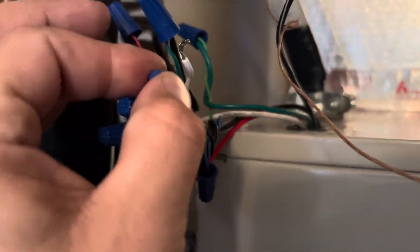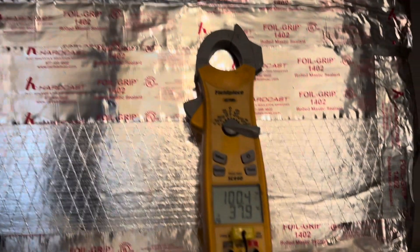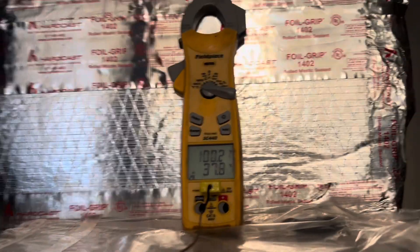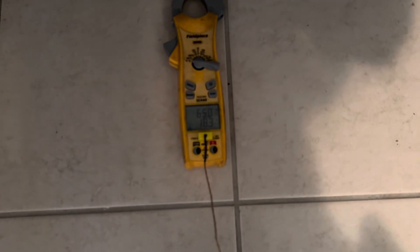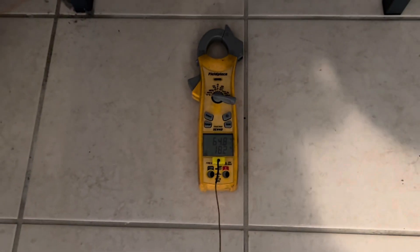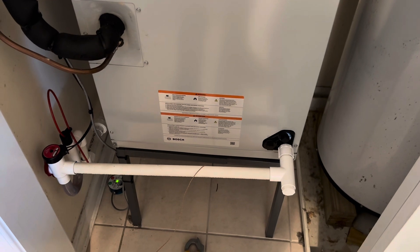This thing is making some decent heat. I still have the thermostat jacked up, but I disconnected W so I'm just getting heat pump heat and not electric heat. 100 degrees — that thing is doing great. Let's check the return now. It has an open return right here and a vent in the ceiling that's ducted over, so it does draw from the space even when the closet door is shut. A little weird setup, but it was like this before we changed the unit out. We've got a 35-degree split — 65°F return to 100°F supply. This thing is doing work — hell yeah.